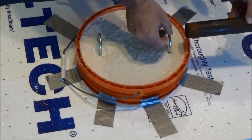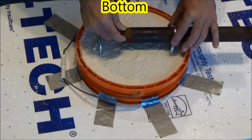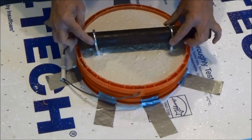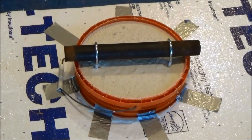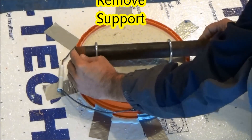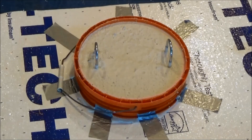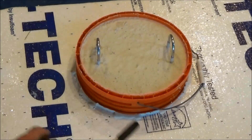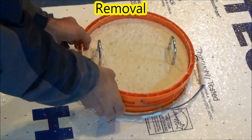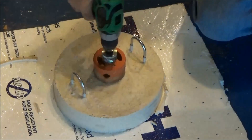After they've set for a few minutes and things are starting to harden up, you want to slide something through the U-bolts to lift them up off the bottom. I actually used a longer piece of inch and a half steel pipe to lift them up and make sure they were in line with each other. And then once it hardened, you can remove your cross brace. You want to be careful because even though the plaster seems like it's hard, it's still not fully cured. Even though the plastic bucket is very smooth inside, the plaster still holds on very tight to it. So, to make it easy to remove the ring, I heated it up a little bit with my propane torch, and once it was hot, it came right off.